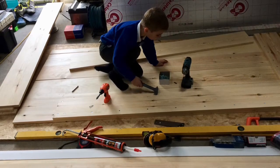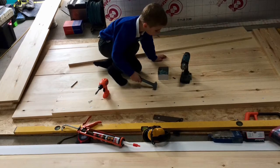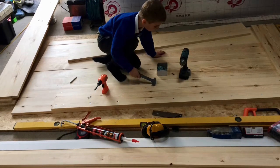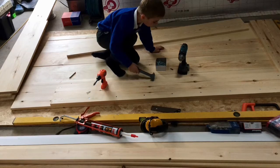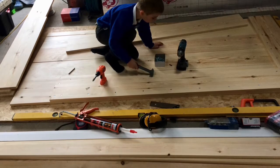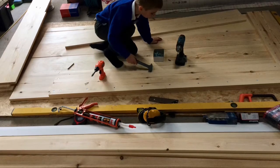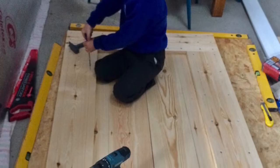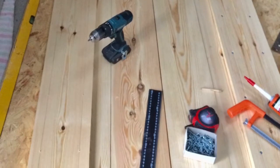So I've got some help here fixing up the first of the side panels. The timber I'm using there is 8 inches wide, which makes sure you get a nice span to hold the narrow side sections of the door to the centre panels. It's a length that, once you put on the base cross section, will give you a couple of inches gap from the bottom of the door upwards to the kick plate — I'll explain why later. Repeat the same process on the other side of the door and that gives you your two finished side edges, and then you can measure from that and make sure you're all square.